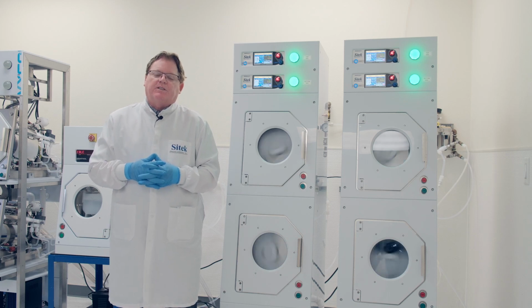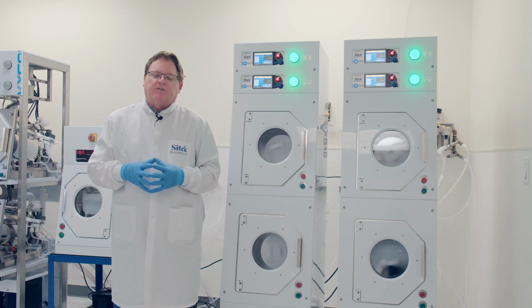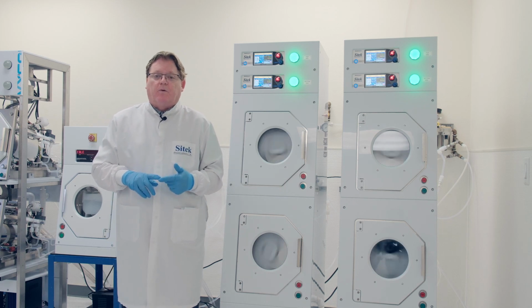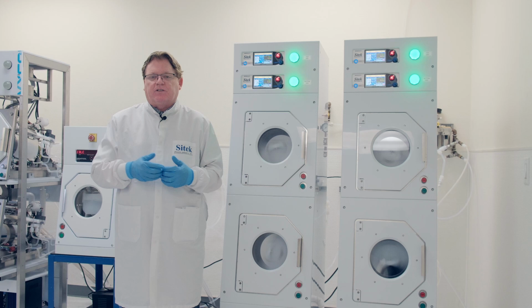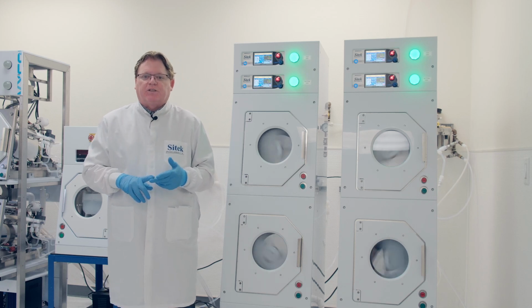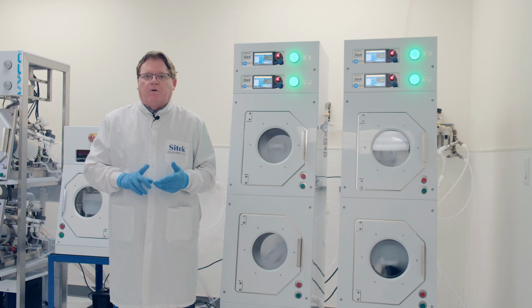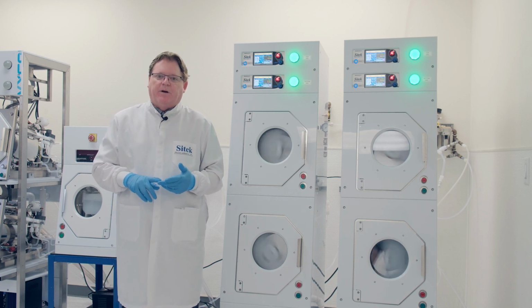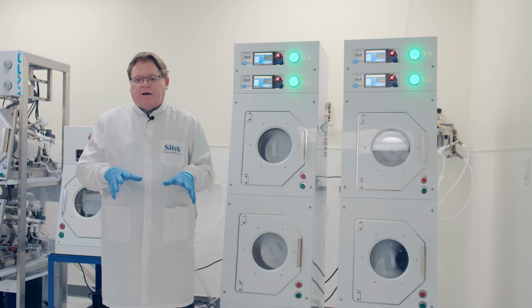For film measurements or surface preparation measurement, we do the KLA Tencor type particle counters. That would be the 4500, 5500, 6000 class, all the 6000 machines. We also do Nanometrics, parametric systems. I know we do the 4 dimensions, 4-point probe, etc. So we do a lot of KLA parametric systems. So that kind of rounds that out.